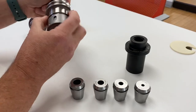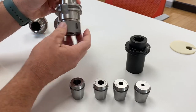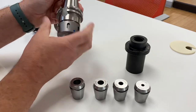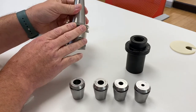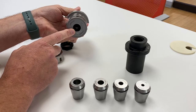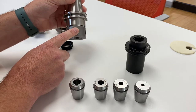This is bigger than the safe zone area, so it's not going to work in older or low-end machines that have umbrella-style tool changers. Vibration dampening is going to be considerably better. We've already tested this chuck with regular ER collets, and now we add the shrink collet into it — so now we have the grip force of a shrink collet and the vibration dampening of this chuck.